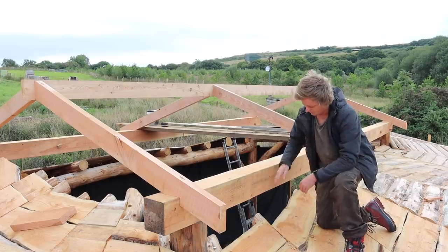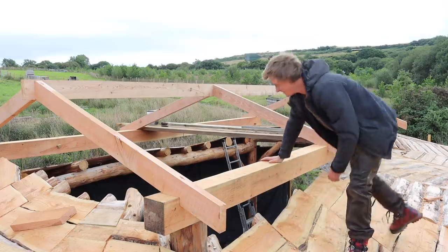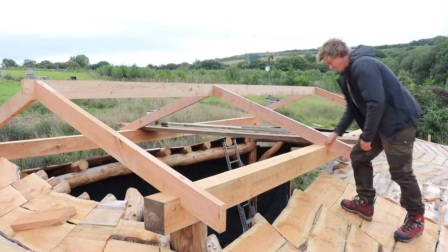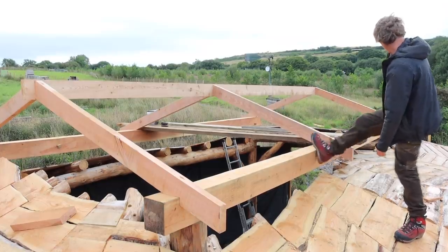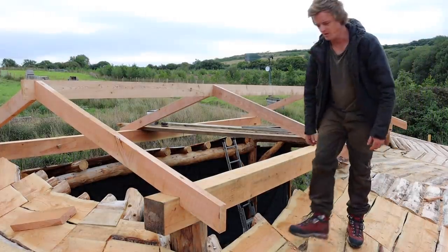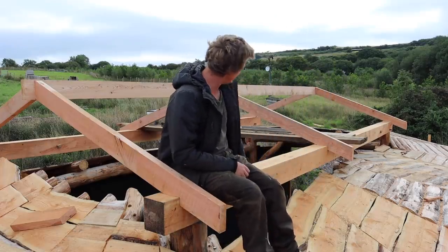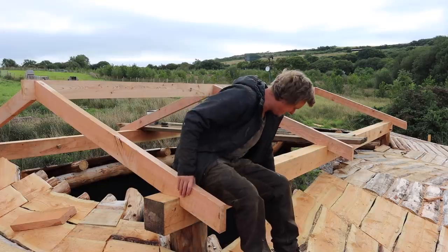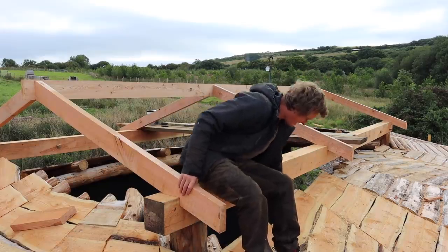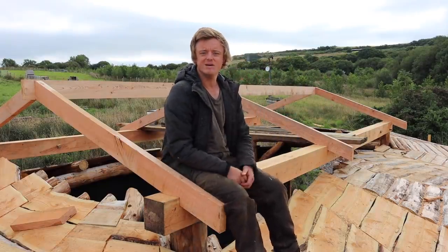So yeah, it will support them from moving downwards and outwards, particularly in the middle, because of the long span, there is flex in them, as you can see, certainly way too much flex. So yeah, that's what we're going to do with that, is notched into these will be supports that come down here at a relatively shallow angle, and then the roof will be built up against there,